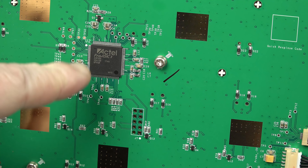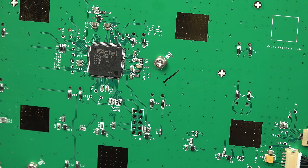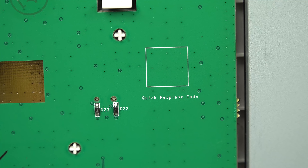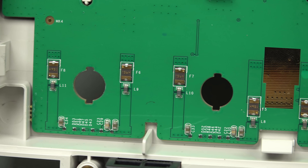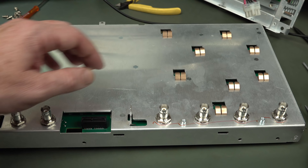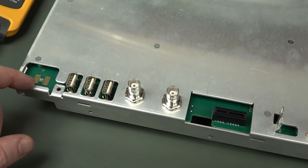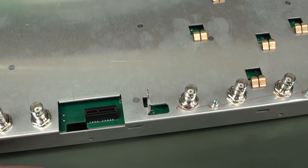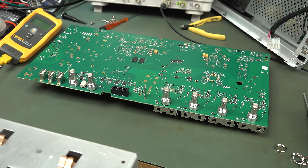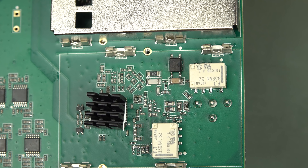We're in! There's the LCD part number. And the encoder and front-panel PCB. I always find it funny when you find a different brand FPGA — we've got an Actel ProASIC3, which is a different FPGA to the Xilinx parts we see on the main board; almost as if it's a different design team. Notice the polyswitches on the external probe interfaces — you don't want users shorting out the power supply. They're really making sure of the RF shielding connection to the main board — that's what all the gold pads are for.